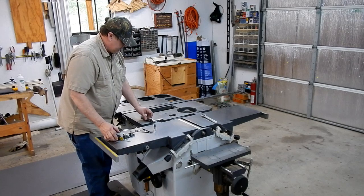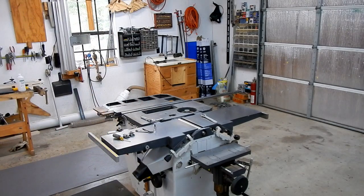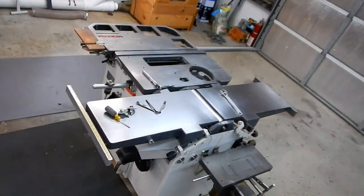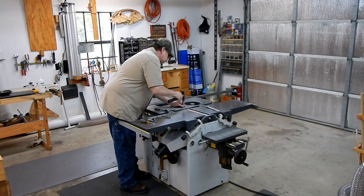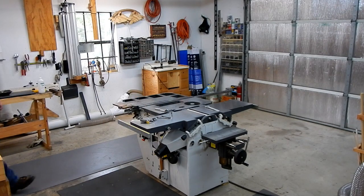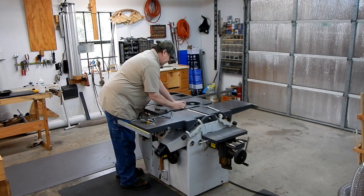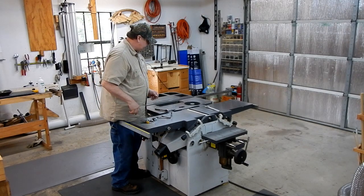I'm going to bring the camera over here so you can see the pulley. In the second slot for the belt, you will see the roll pin — the hole for the roll pin — and that's what we're going to take out next so we can slide the pulley off. Now you just need to take a roll pin punch. There it is, and it fell down to the bottom of the cabinet. That's why you want to vacuum the sawdust out first so you can find that roll pin — otherwise you're probably going to have to buy another one. The pulley is just a slip fit. Originally when I pulled it off the first time, I had to take a puller to get it off because it had corroded between the pulley and the shaft.